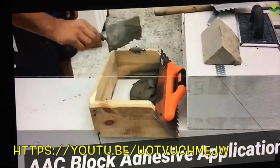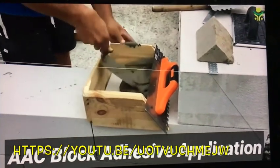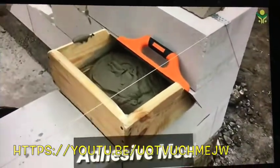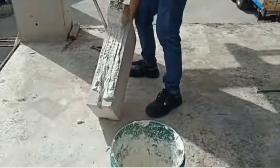No strength. This whole garbage of cupping for tiles just leaves a hollow spot, right? Drop the fork, boom, tile's gone. Anyway, same kind of principle. You have to think tiling when you're thinking of AAC block. You need to understand the word aeration and the reason why this application here, again, I'll show it another time, how it's being scraped on, the slump is correct, is quite soupy, and you can see where these shovel things just don't work.